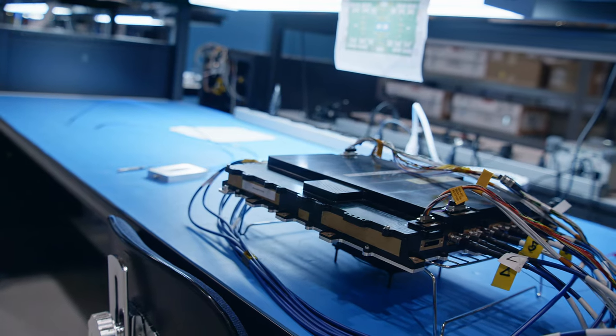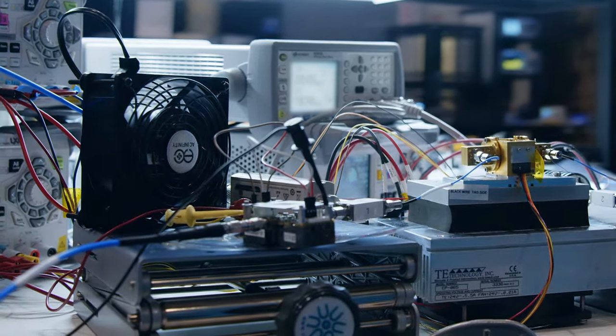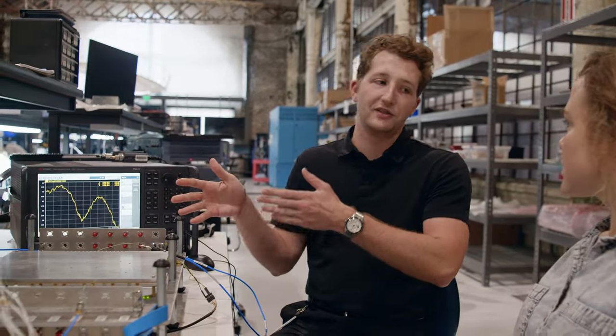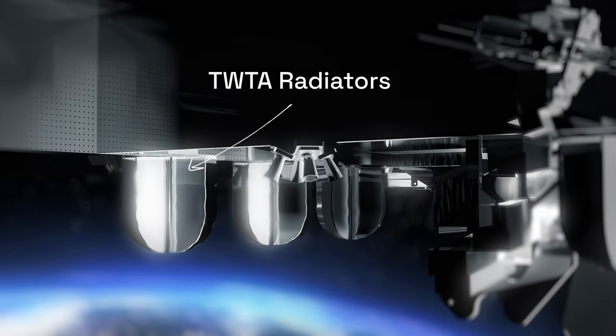At the end of the day, we have a very small area and we need to fit electronics into it. Those electronics are going to get hot, and that makes it challenging because when electronics are hot, they're less reliable and their performance is worse. Basically, we need to find a way to place components in optimal locations, work with thermal folks to have a good thermal design, work with mechanical folks to have a box that can fit and reject all of that heat, and make sure the different electronics in the box are not going to interact with each other in ways we don't want.